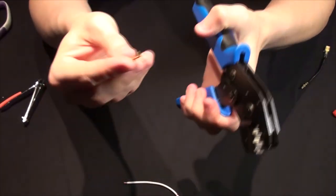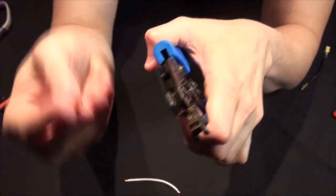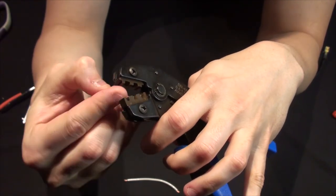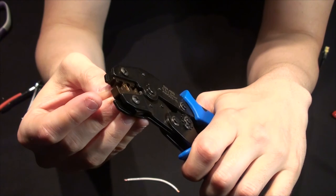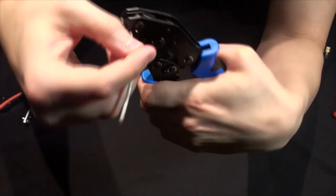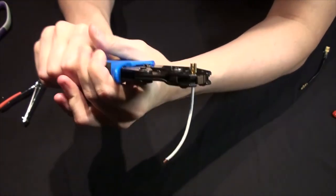To crimp and secure it, take your crimper — for these, they take a one millimeter hole, marked as '1'. There are little steps on the crimper. Because this is a two-part connector, put the big fins in first. Match the valley in the crimper with the mountain of the connector. Because this is a ratcheting crimper, just squeeze it down a little until you get a first click. Then take your wire, put it just far enough in, check the other side to confirm it's seated correctly, then give it a good hard squeeze. Once it's down, let go, release, and push it up from the top.